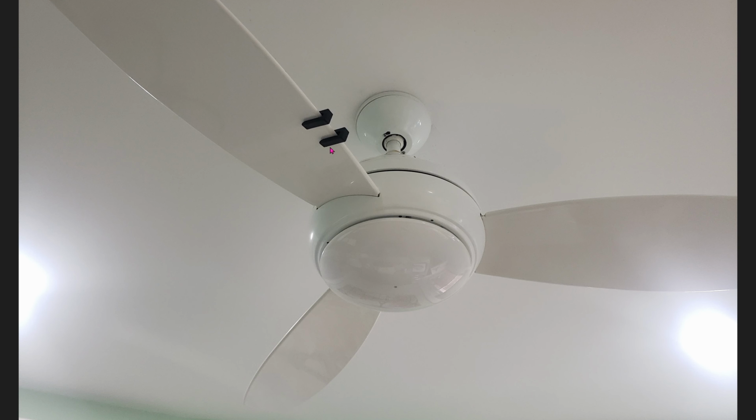Honestly, sometimes using one clip does not help. Try using 2 clips. Oh yeah, the position of the clips on the blade helps as well. So go ahead and play around with the position of them. Maybe they're next to the center, maybe they're far away from the center. Here you can see I found the sweet spots to be here using 2 clips.